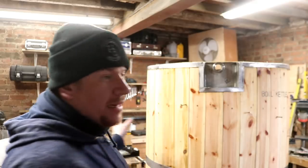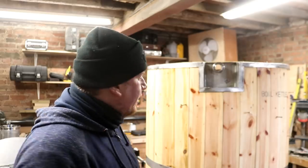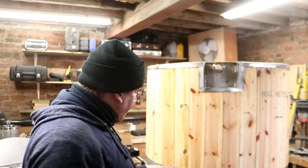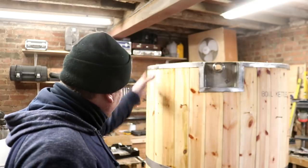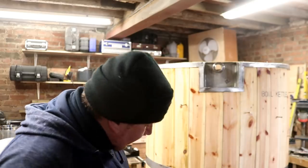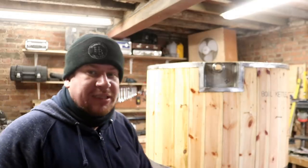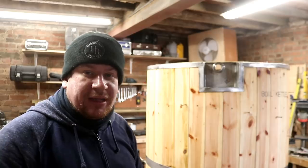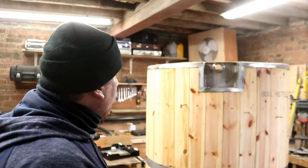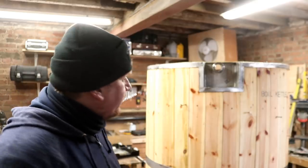Whilst I'm in here as well, I'm going to add some reinforcing bars to the lid so we can actually bolt the lid in position and prevent it slipping and sliding off with the weight of the chimney. Then once I've done that, I'll put the chimney on and we'll find out where it hangs down this side. I'll see if I've got the steel to do it, but then we'll see if we can stick a few brackets on there to try and just take the weight of that chimney off the lid a little bit - hopefully giving us less movement over the top.